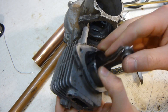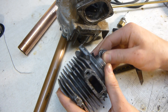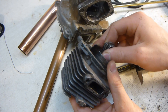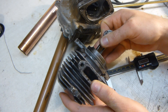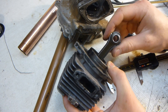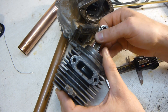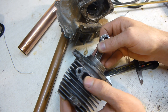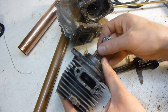What happens is your cylinder starts out — let's say it just starts out in the down position. It's just compressed a gas-air mixture. The spark plug down here fires, so you get a combustion inside there. Your piston starts moving back. The energy from the initial explosion is transmitted to your crankcase, to your crankshaft and everything, making your engine spin. As it comes back, it first opens this exhaust port here, which lets the high-pressure exhaust gases escape into the exhaust manifold.